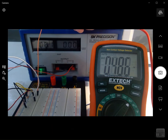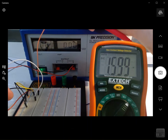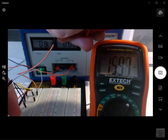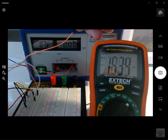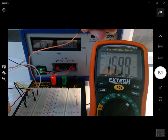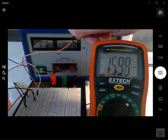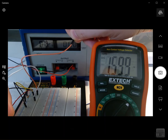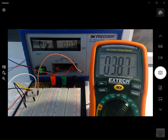When measuring a real circuit board, you generally don't want to hold the probe wires with your fingers. Right now I have 1.599 volts going across my body. It's fine because this is low DC voltage and low current — your body has enough resistance that 1.599 volts won't push any substantial current through you. But with high voltage, you absolutely do not want to do this, as you could seriously injure yourself.